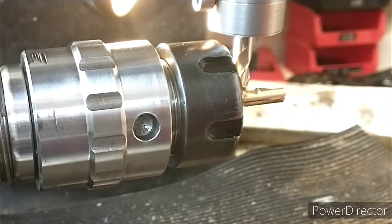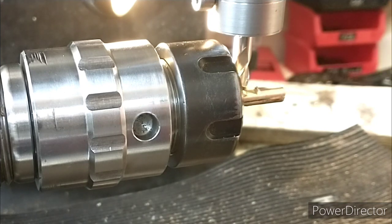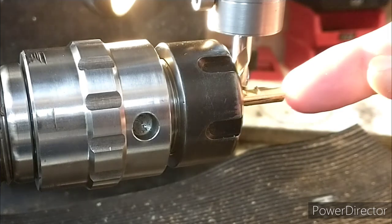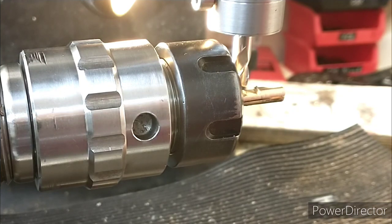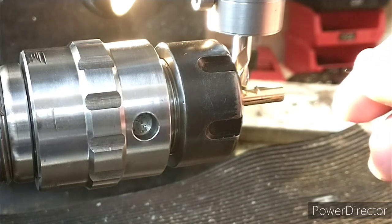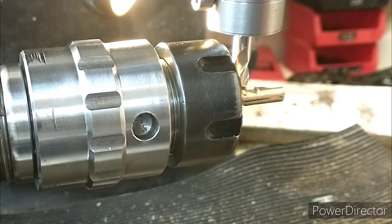I've just done the clamping flat — machined it at 1mm depth, which doesn't give me much clearance to the actual cutters once I've bored through, so that's going to be about 0.4mm. It should be 1.2mm depth but I think that's getting a bit close to the bone. I need to put this into a 6mm collet and turn it around to bore it through.